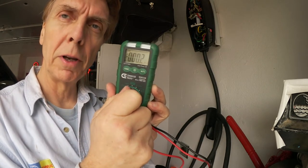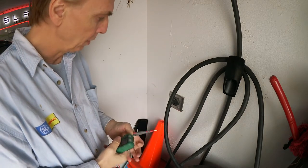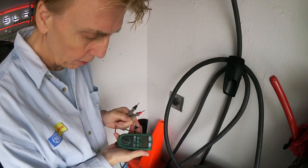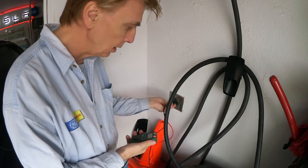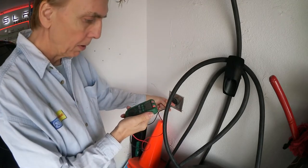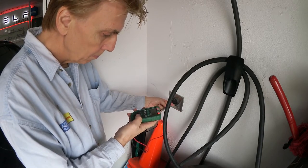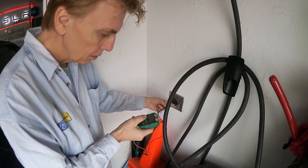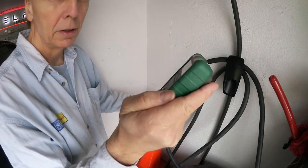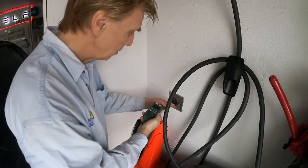All right. The first thing is, we are measuring on another device to see if the meter measures correctly. For that, I have here another backup 240 volt, 14-50, NEMA 14-50. You can also measure it on 120. So you put it on volt, and then you stick that in here and see if power is there. Actually, power is there. It measures DC. It should not. Let's go to another function. AC. So as you see, AC measures 247 volt. Yes, here, 247. And then if you want to measure only one phase, you can put it on the neutral.